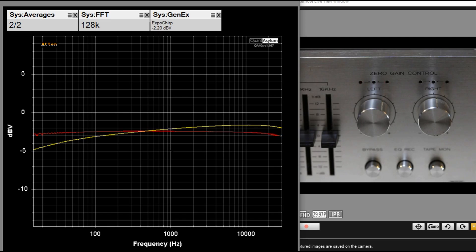Under that condition, the specification was you should have not more than half a dB of gain to minus 1 dB loss across the band from 5 Hz to 50 kHz, and we're only going out to 30 kHz. If we look, we can see that the right channel does meet that — there really isn't much of a rise and it never really drops more than maybe half a dB. The left channel, however, is down maybe 2.5 to 3 dB from the peak, so the left channel is not quite meeting that specification.